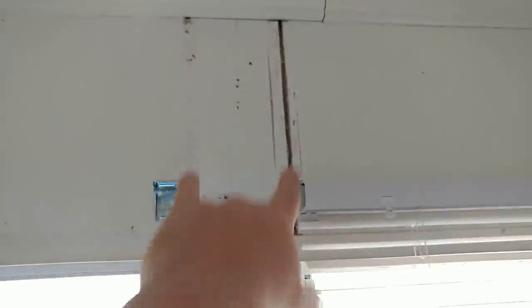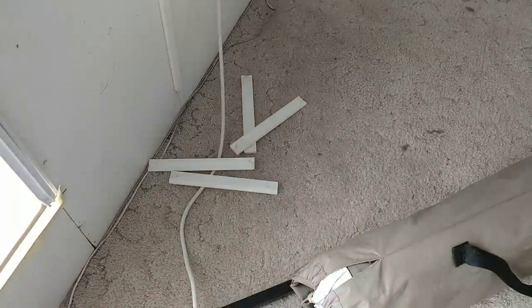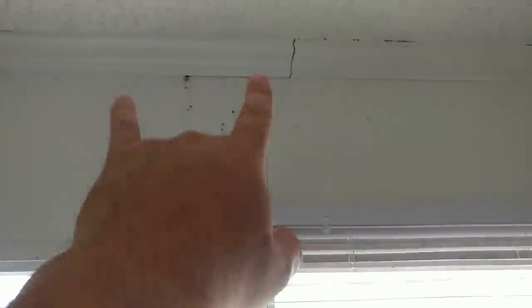There's a way I like to do these. I got rid of the little trim pieces that were right there — those right there. I'm going to properly putty-fill those when I repaint these walls, because those things all over the walls look really ugly. It's because they were too cheap to do a proper sheetrock job. So I will redo that — properly putty-tape them so it'll be a nice smooth wall.